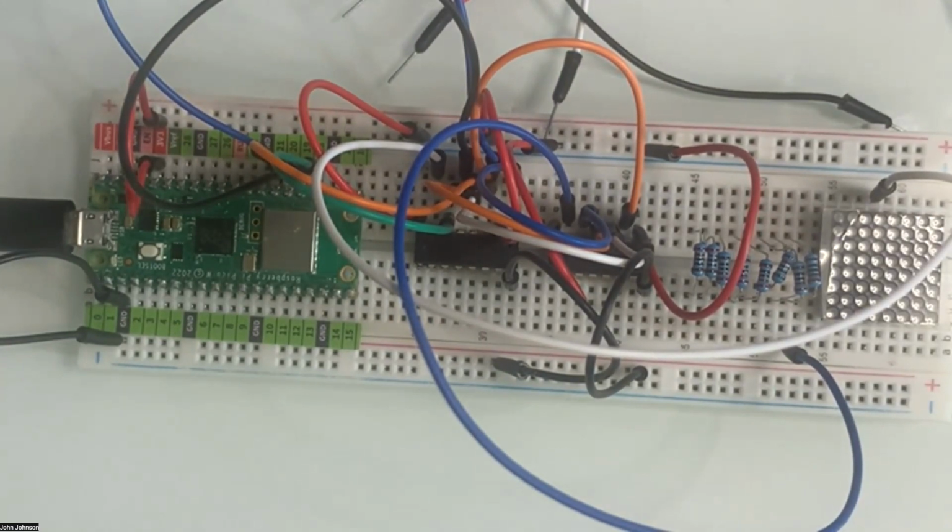So looking back to the top of the second IC, we've got the first one going to power. The second one is going to that. Then the third one we daisy chained with the first. Then we've got the next three are the inputs that are daisy chained as well. So all those, the four in a row, are daisy chained. Then we have the second to last going into power. And then we have the last one open.